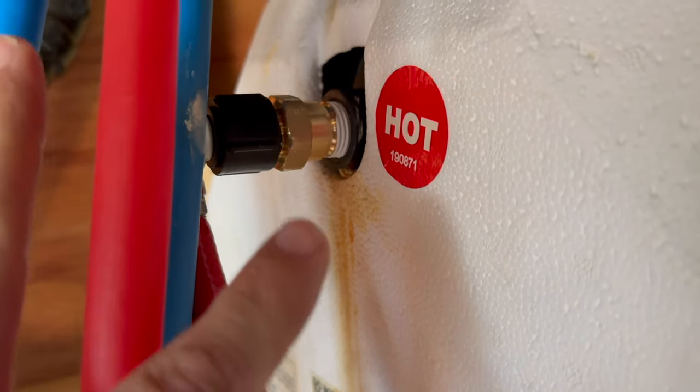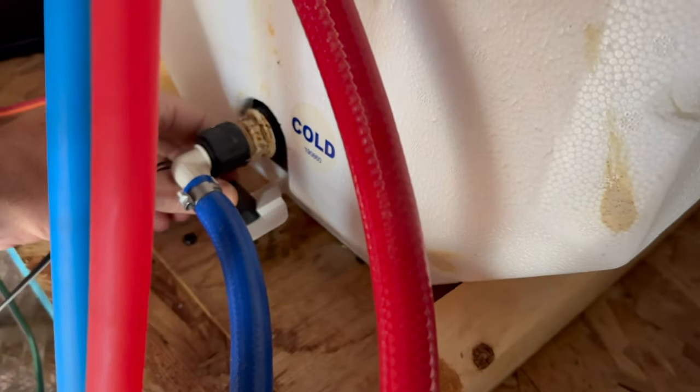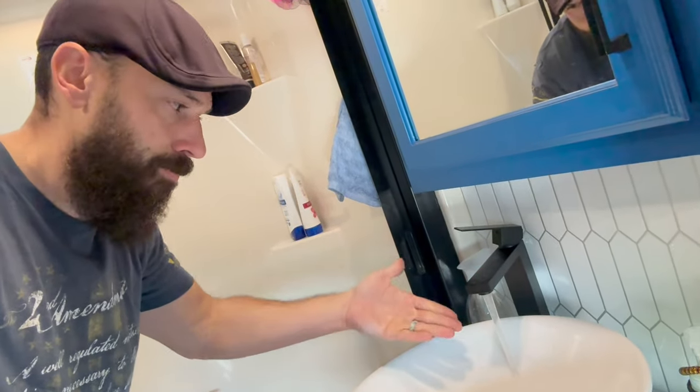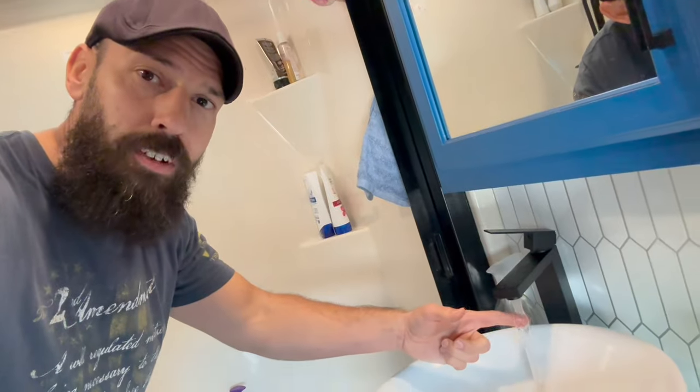First, let's go to the other side of the basement and make sure nothing's leaking. Everything looks good here — no leaks. I'll keep this basement door open for a little bit to keep an eye on it, and I'm also going to place this water alarm detector right down here where if I do get any drips, it's going to go off. Okay, let's see the big reveal. We're going to switch this over to the hot water side and turn it on. Water's flowing — problem solved. Just a check valve. Obviously this isn't hot because we haven't turned the heater back on yet, but there's going to be air in the lines and it's going to be spitting for a while until everything gets pressurized and all the air gets out.